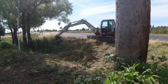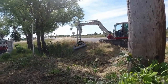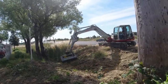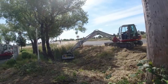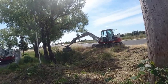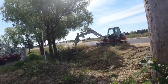They sell them down here at Global. I didn't know too much about Takeuchi, but I test drove the TL-12 and loved it — still love it, almost 300 hours on it now, no issues. She's rocking and rolling every bit of what I hoped out of a skid steer. When it comes time to upgrade the 080, this would be 100% the machine to get. It's a lot smoother and the controls on it I like. On the 080 you've got to get into it, turn on the hydraulic flow to the head, hit a different button to turn it on, then hit the trigger to engage the head. This one you just hop in, drop the bar, and go to town.